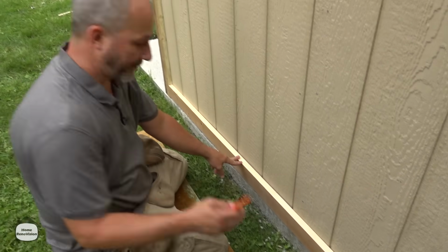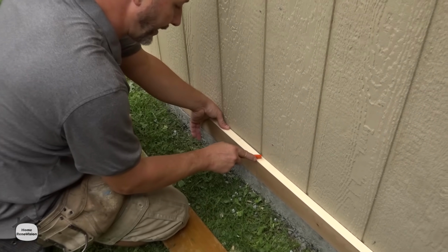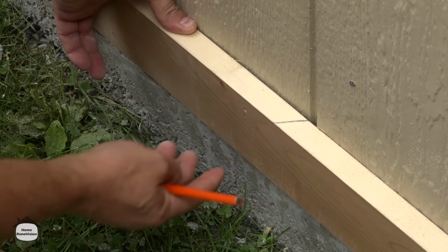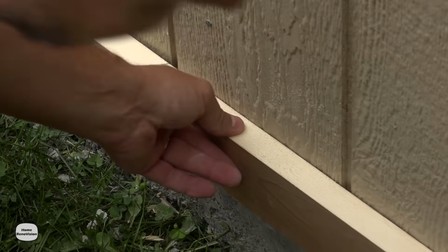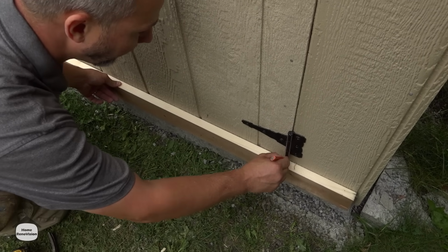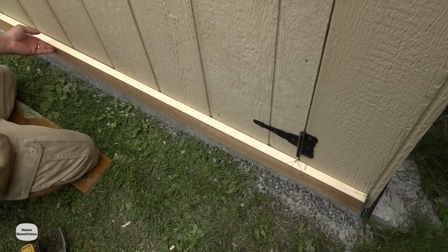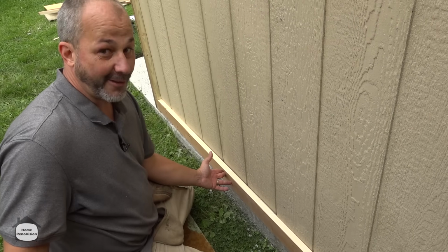This is the best part because this is our door. The way we're going to do our door system is we are going to have the base trim from the door overhang, and we're going to have it join on that 45-degree angle right here. So we'll cut that through, attach this to the door, and then over here, at this point, we'll cut that off. We'll also put a 45 here, and then the end piece will have a 45 there. So it'll open to complete 90, plus the gap, which will give you about a 100-degree opening, which is more than enough to get your lawnmower out.